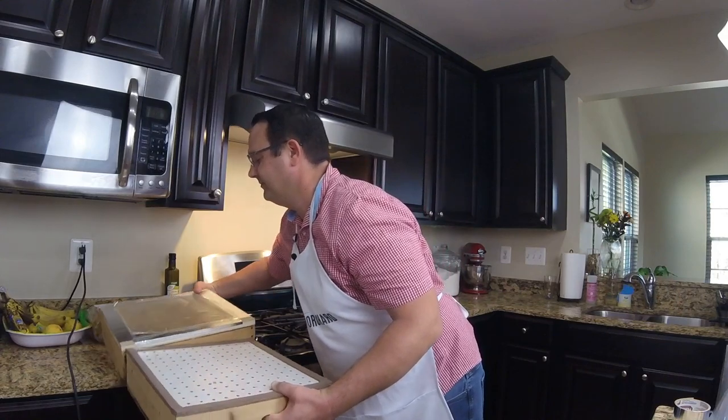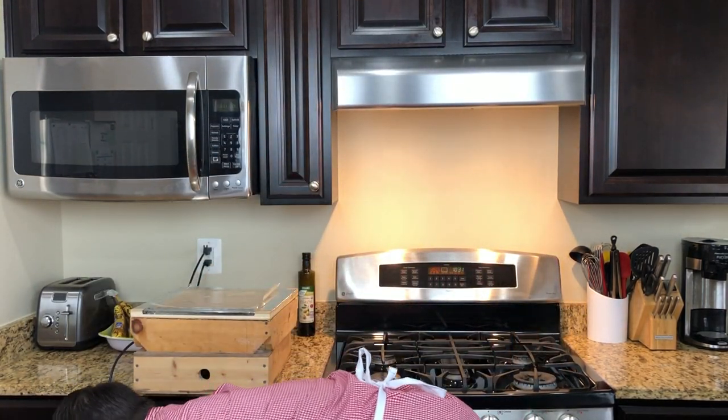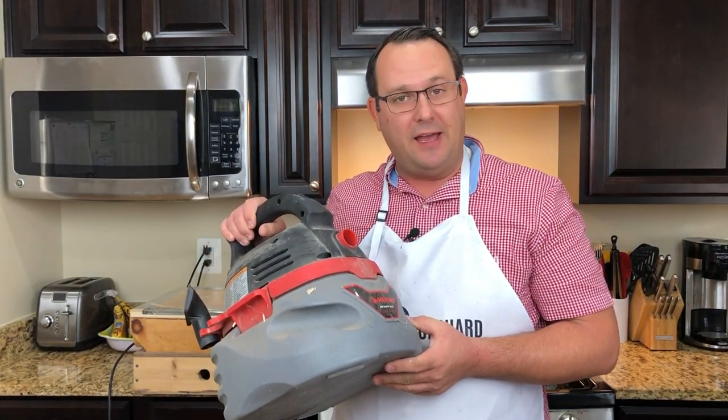Which leads me to the next ingredient — my shop vac. My shop vac is a very small one, dirty and old but reliable. You can use your shop vac, just keep in mind that some shop vacs are a little bit stronger than others. Things can vary depending on how clean your filter is. So for consistent vacuum, I suggest putting in a new filter each time you're ready to do a pull, especially if you've been cleaning the shop and various other things.